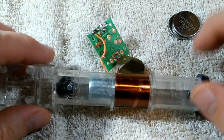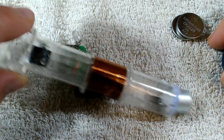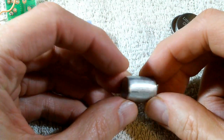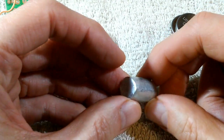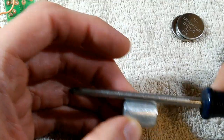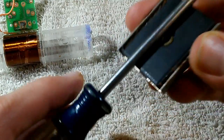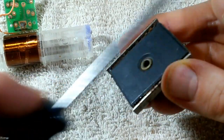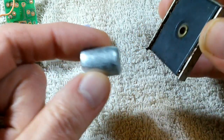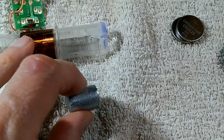I was curious about this piece of metal sliding back and forth. I managed to get the top off and slide it out. It just looks like white pot metal — pot metal is a waste metal made of a combination of things, probably a little aluminum, a little tin, maybe some copper, maybe some iron. The first question you might ask is: is this even magnetic? There's no magnetism coming from this metal at all. Now if I take a real magnet, it sticks — this is steel, a real magnet. If I bring the pot metal up to the magnet, it will stick, indicating there's probably some iron in it, but the object itself is not magnetic. So even if these wires were hooked up, this thing couldn't generate any electrical current.